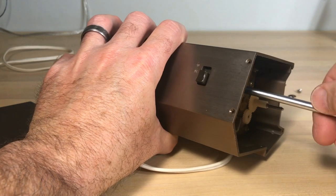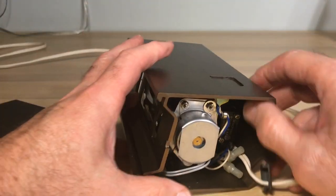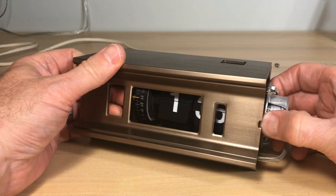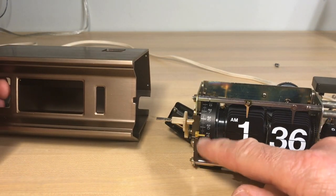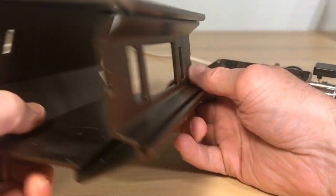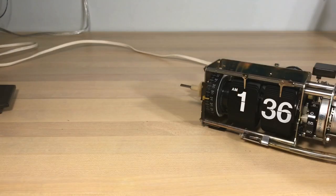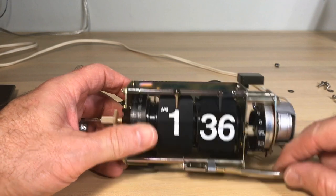On this 702, you want to loosen this switch to get it out a little bit easier. You've got to be careful sliding this out — it's very tight. I would imagine it was really a problem to assemble these things. You've got to be careful that right there wants to catch on. It's an extruded aluminum case, all one piece and anodized.